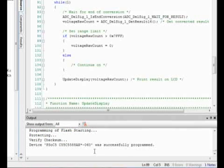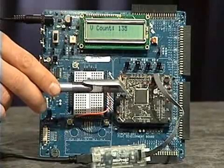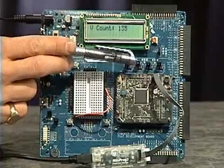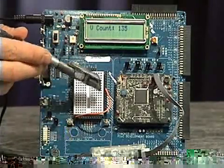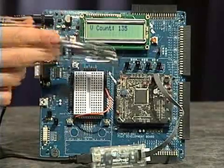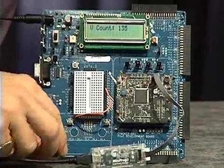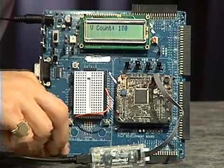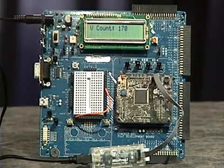Let's take a look at the actual board. As you can see, we've installed the PSOC 5 processor module on the DVK. We've connected up the MiniProg 3 to the processor module with the included ribbon cable. We've wired the potentiometer to one of the IOs that's connected to the PSOC 5 processor module. The LCD screen is displaying the counts value from the ADC, and as we change the pot, you'll see the screen update the value. With this simple project, we're able to create and program a design which takes in an analog value and displays it on an LCD screen.